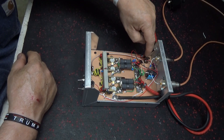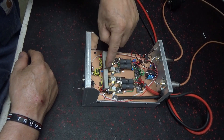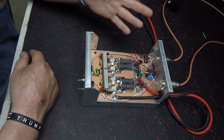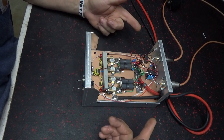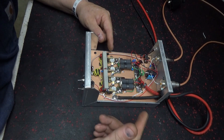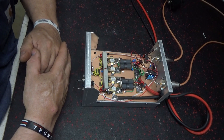When that relay switches to this leg, it sends — say 12 volt, 14 volt — 14 volt from here, over to here, goes up here to this block resistor, and then it goes through these resistors which dissipate heat, and then it goes to these diodes which are 1N5822s, and I get my bias voltage. Pretty simple.